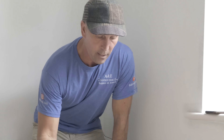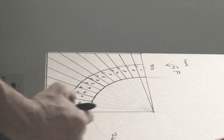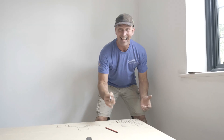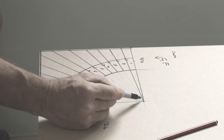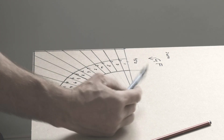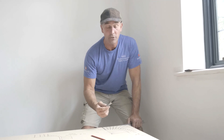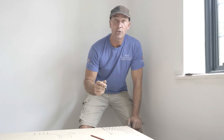What I've done is marked out my case at 950mm. From this point, my measurement outside is 2.6 and 2.6. I then join the pieces together — joining that point to that point, and that point to that point — which allows me to get a trammel and arc it all the way around to a lovely curve. I put my trammel point in here, go to my 950 point, and arc it all the way around. I then go to the centre of the 950 and arc that all the way around as well.